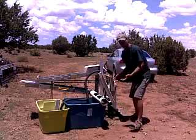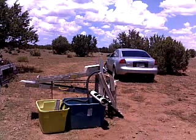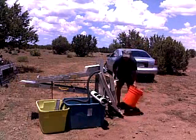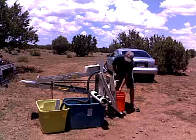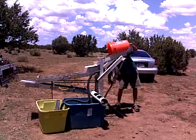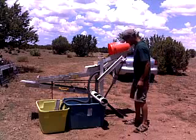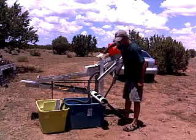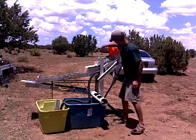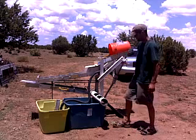There it is set up. Now I'll show you what the back end is for. Here's your bucket of material — you take it and on this back gate right here you set it up like so. This will lift up onto your system as a brace and a lock. Your material holds itself up, it's adjustable for angle, and you have a gate you can open and shut to feed material into your sluice box. You don't have to hold any of this weight. You don't have to use the bucket either — the tray itself can be shoveled into.